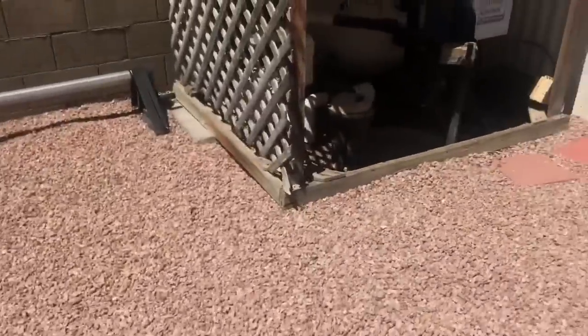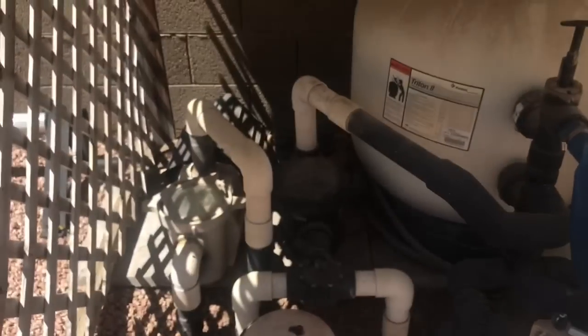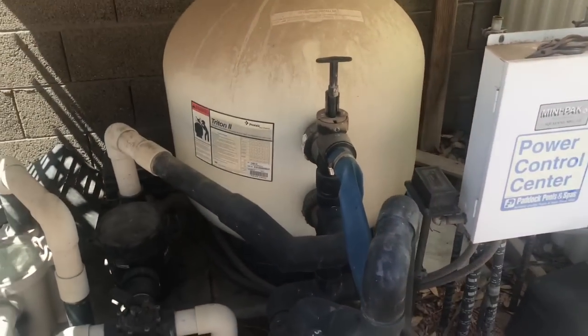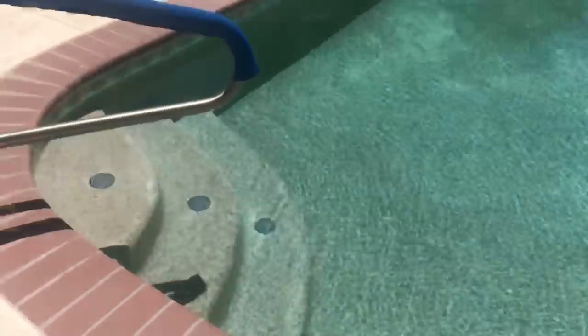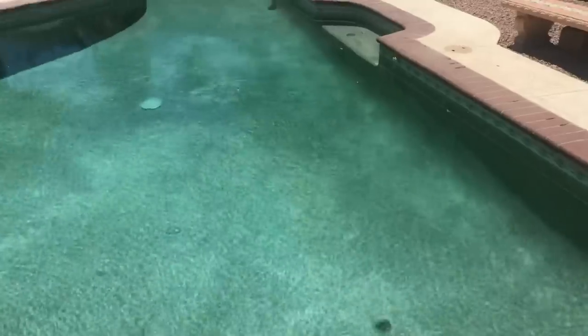One thing to keep in mind with a system that has a separate dedicated pump motor for the pop-ups: if you want filtration to happen — meaning filtering dirt — you've got to make sure your filter pump is running at the same time your pop-up pump is running. As the pop-ups blow the debris up and suspend it in the water, those particles are then sucked through the filter, which filters out the dirt, and the debris is hopefully caught in the skimmer and the leaf catcher.